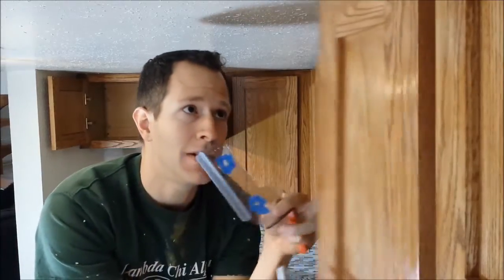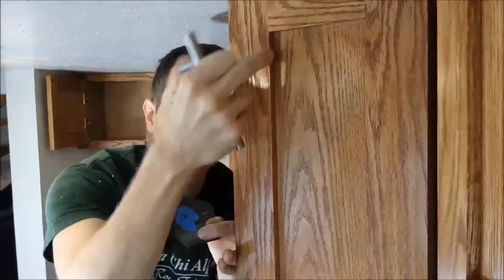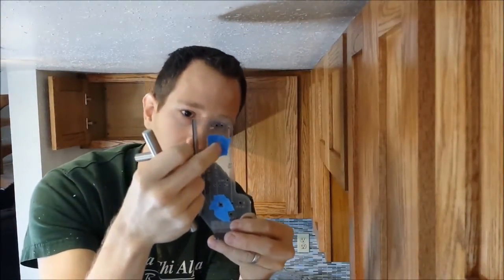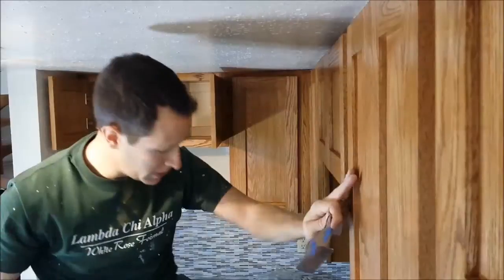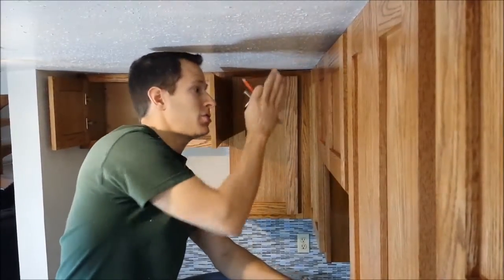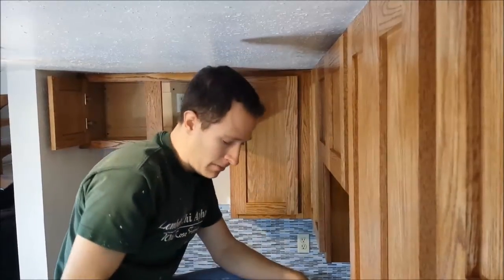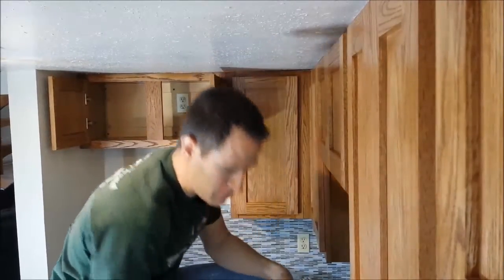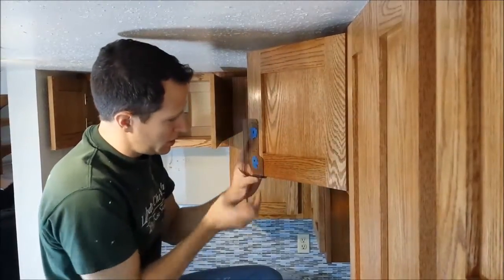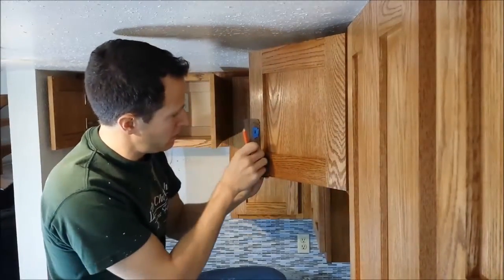I want to put these on my cabinet doors just about in the center. It doesn't have to be perfectly centered, but more or less. I'm using the 1-inch guide, 1 inch out from center, so the holes will be 2 inches apart total. Before you get started, you want to make sure your cabinets are already adjusted — perfectly straight and square with an even gap in the middle. Then get started.